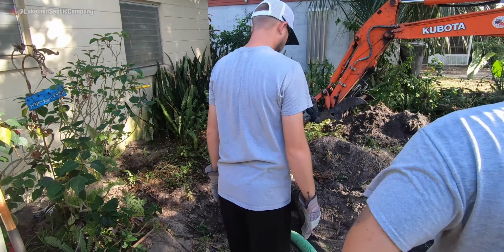It's 225 square feet, 15 arc chambers. The job we're gonna do tomorrow is also arc chambers. That's just what we have right now. It's what you're able to get. So we're gonna jump on this one. We're making good time right now. We still have to relocate the water line. So once we get this, we have to figure out what we need, go get it. So we're gonna get the drain field filled in now.